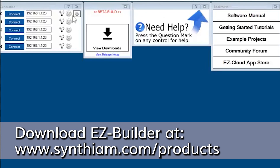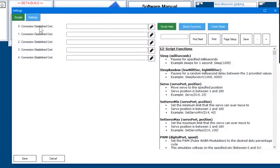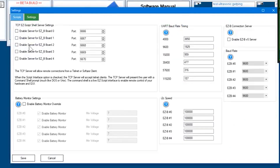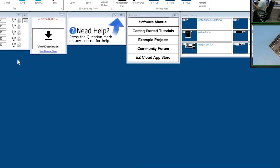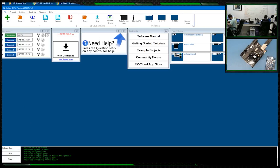Let's load up Easy Builder. I'll click the gear icon to configure the connection control, use ID 0, and specify the baud rate — 57.6K, which we saw in the firmware configuration before we programmed it. We're not connecting to an IP address since we're not on a network; we're connecting to the COM port. When I push Connect, we're connected and there's a bunch of information down here.